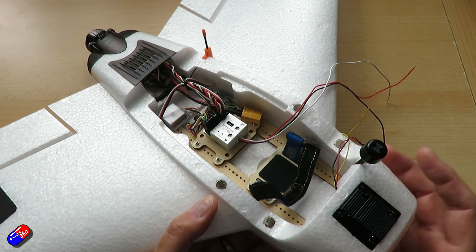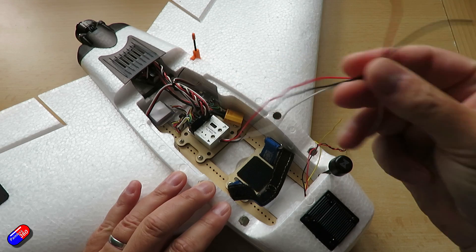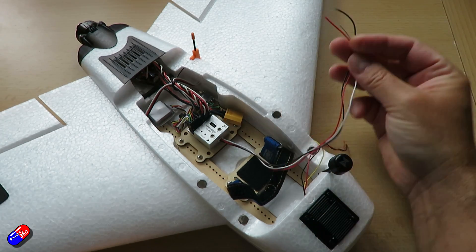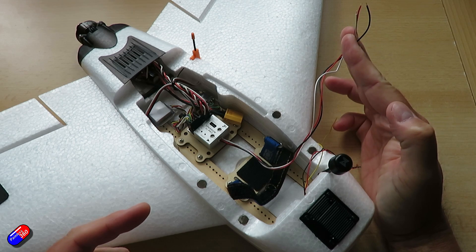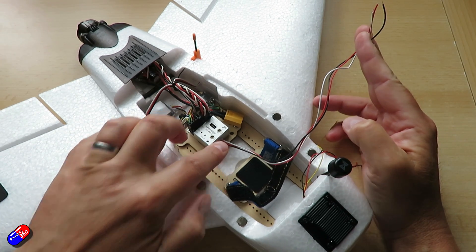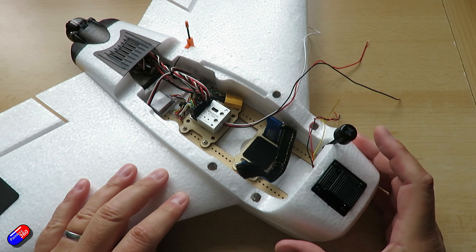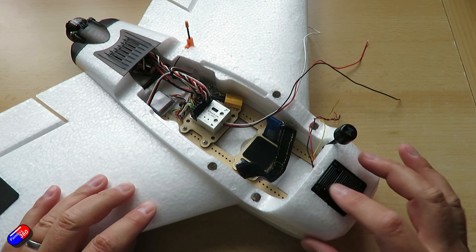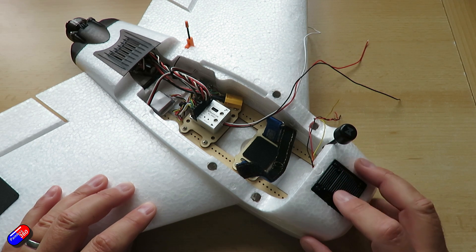The next thing we have to do is a little bit of wiring, and I suspect this is where people are getting into a little bit of trouble. There are three cables that come out of this little connector at the front, and this is where all of the magic happens. There is a black and white cable and a signal cable as well. These three cables actually don't power the FPV system at all — they provide a ground and a signal which is what goes into the HD FPV system to create the on-screen display. It's basically a telemetry stream that goes from the Sparrow V2 Pro into the avatar.